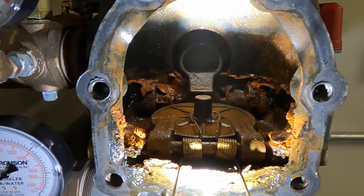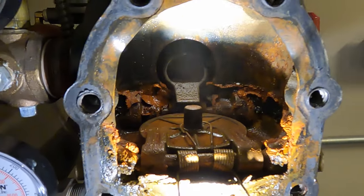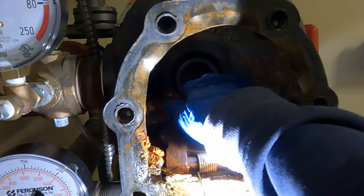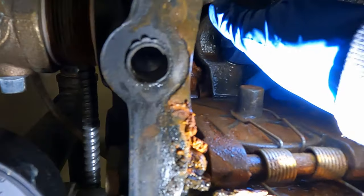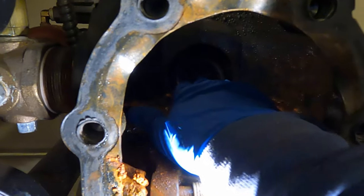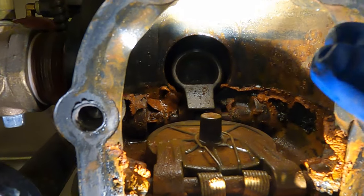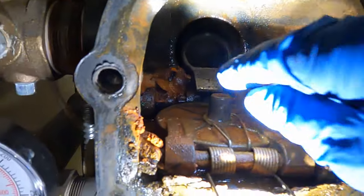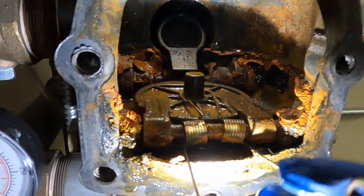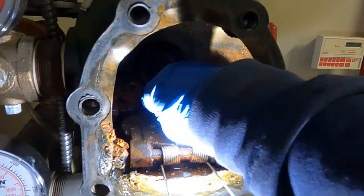You can see inside here — the cold air is coming back through the pipe, kind of steaming. It's a little cold out today. You can see how this pushes down onto the clapper and holds it shut. When there's water pressure in that back section, that's going to push the rod out down here, which holds the clapper shut. Once that water pressure comes off and that releases, then the water pressure on the clapper will force it open. And then that springs shut — actually a lot better spring on these than the old 756s.